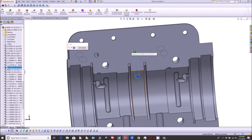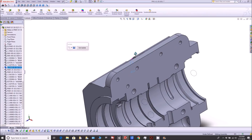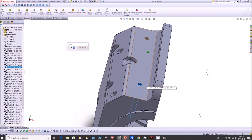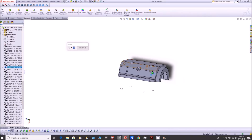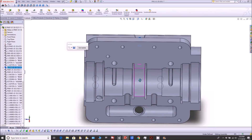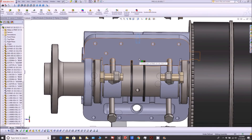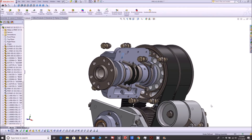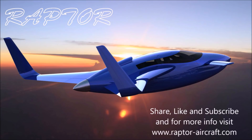That's basically that one circuit. For the oil feed to the prop, that's coming off the high-pressure feed from the governor, going in through that fitting into the prop. Some will blow by those washers and drain back into the sump and then back into the engine. So two separate oil feeds at different pressures, but ultimately draining in the same spot. Mark should have the drawings finished by next week and sent off for milling — that'll also take about six weeks. In terms of what's happening next week, I'm going up to Oshkosh on Thursday evening and I'll have a video out Friday or Saturday. After that there may not be a video the following week. Anyway, that's our update for the first half of this week — thanks again for watching.